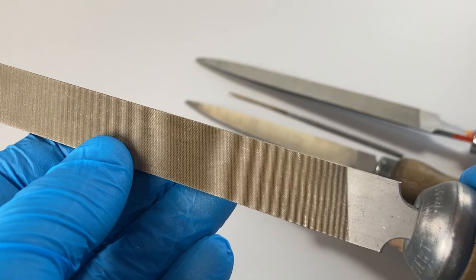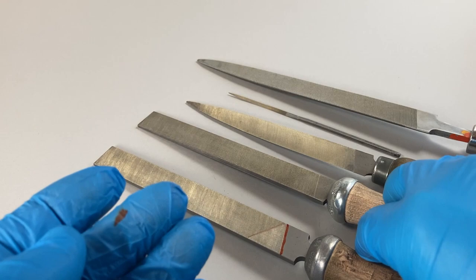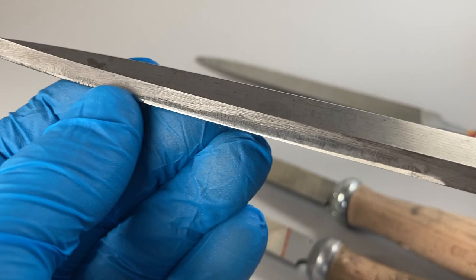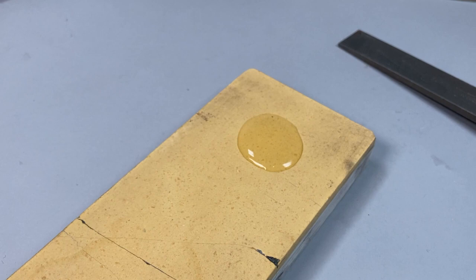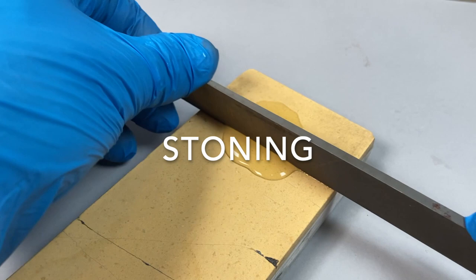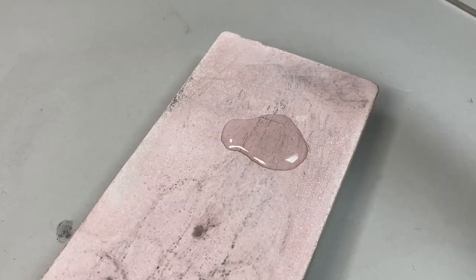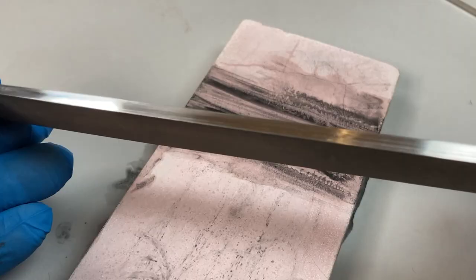Let's talk about the safe edge. Four of the five files we're discussing today have safe edges ground on them. As a broad rule, you don't use a file exactly as it comes from the manufacturer. The safe edge on this file has a little bevel on it and sometimes the teeth actually curl over slightly. To make it more useful, take an abrasive stone — here I'm using a 1000-grit ceramic stone — keeping the file dead square and flat, grinding away those manufacturing marks to really make it a true safe edge. I'm finishing it with a 6000-grit ceramic stone to give it a polish, again keeping it square.